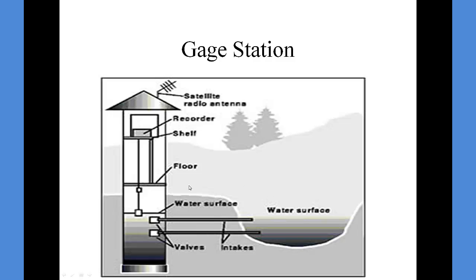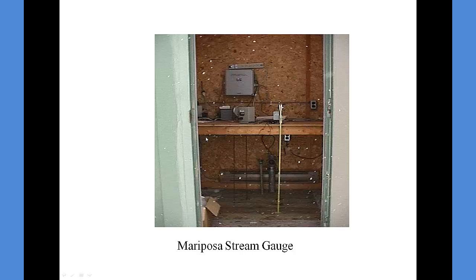This gauge station, shown in lecture, is permanent. When it is installed, a full stream profile is completed, like what we did at Pigeon River and Nogies Creek. Then a stilling well is installed — a three-foot corrugated steel well with pipes running from the river to the well. Water feeds in by gravity, and the water level rises until it equals the stream level. The water level can be monitored with a flotation device or a wireless device. This is great for safety because if the area is partially covered with ice, it's much safer to get a reading from the well.